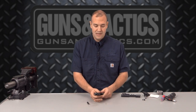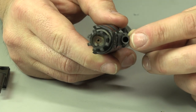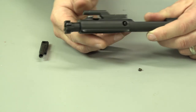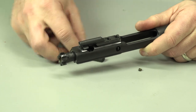If this gets damaged — I've seen them where people take this out for cleaning, they drop it, and the key gets bent. That happens. Even the key just gets damaged on the front. So sometimes we'll need to replace the key for various reasons. This is a good quality key — you can see it's chrome-lined inside. Some of the cheaper keys on the market are not chrome-lined and are made out of different processes that just aren't as good. A good quality cast carrier key is a good investment. If you're going to replace it, invest in a good quality part. I've seen keys break just from use or crappy manufacturing.